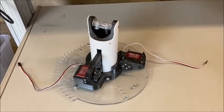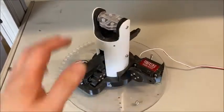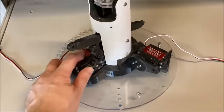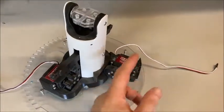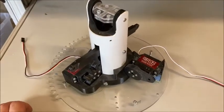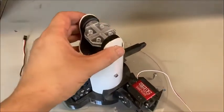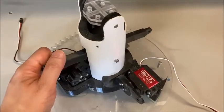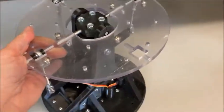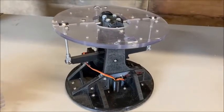What you see here is the first attempt at the neck mechanism, trying to do a pan and tilt so the head wobbles. I have two 20kg servos — one does left and right and this one goes up to an arm for up and down. This used a piece of plastic pipe with 3D printed details. It proved it did work although there is some inherent wobble because of backlash with the gears and the weight of the head carrying on the momentum. After looking at Crane's T7 build, he suggested a flat-pack type arrangement or 3D print.